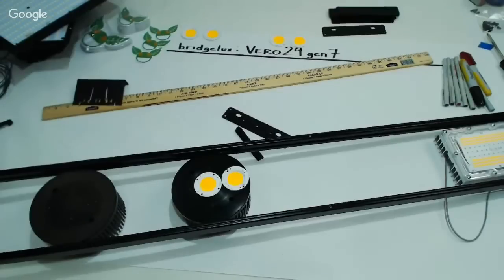So like I said, at the end of the day, a lot of these chips are very, very similar in end performance. And it's different in the sense that the CXB is a 100 to 130 watt chip. The Vero Bs and Cs are 230 to 250. The Citizens are 200 to, you know, they're just bigger chips, and because they're so much more affordable, we're able to use them like smaller chips. And the constant theory that we're using in LED is the more we underdrive and the less we stress these diodes, these semiconductors, the higher they perform. Cool. Right on, man.